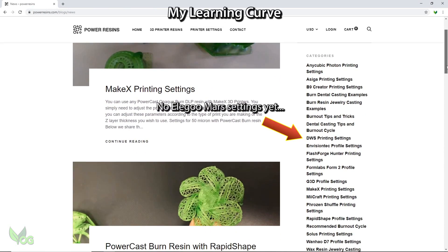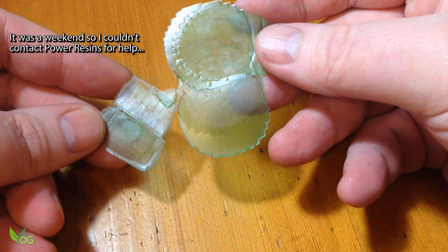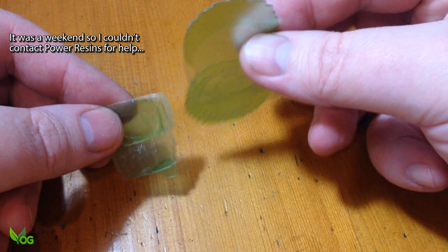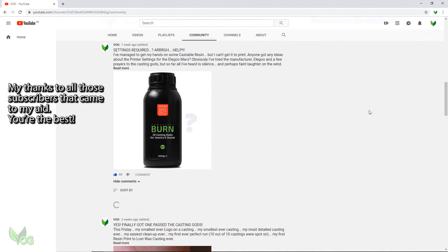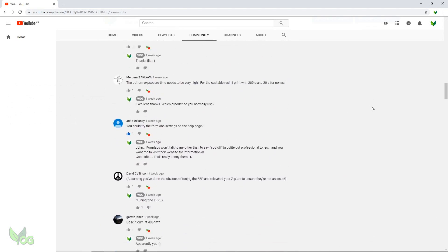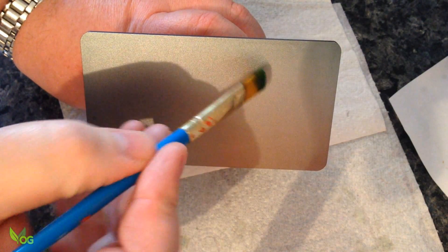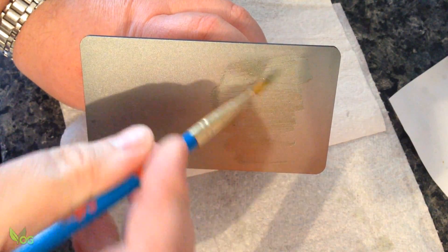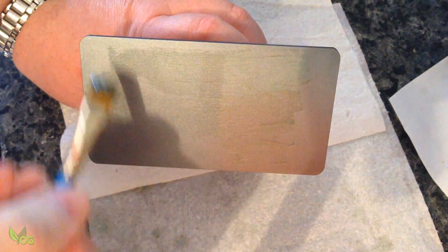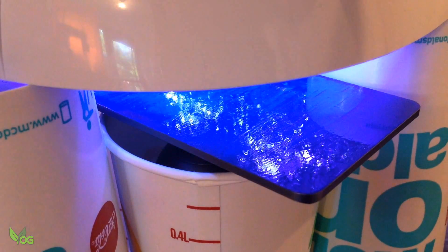The lack of printer setting data did cause me lots of troubles and I had several failed attempts with various settings before turning to my own subscribers for help. Of course they didn't let me down and the solution was a simple but critical one: priming the build plate. The easiest method was to dip a small brush in the resin and spread it evenly across the plate — keep it thin, as thin as you can manage. Let it stand for 5 minutes so the brush marks seep together, then put it under a UV light for 10 or 15 minutes.